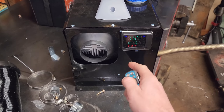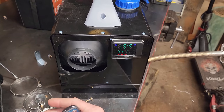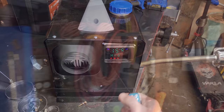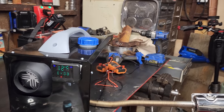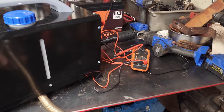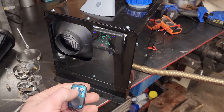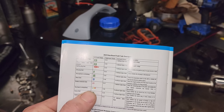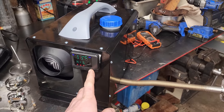The unit has shut down - 46 degrees in here, 31 outside, and we have an E08 code. It ran out of fuel - there's still a little bit in there. Battery's got plenty of voltage at 13.28. I filled it up with another gallon of diesel and fired it back up fine. E08 is flame extinguished, so we can assume it was just low fuel level. I looked back on the garage cameras for when it shut off and we had a solid 10 hours of running on high.